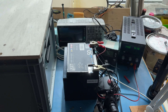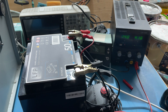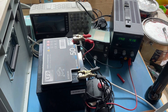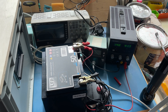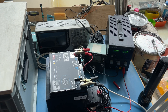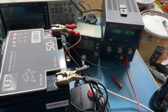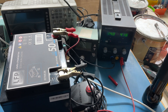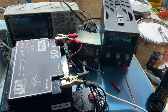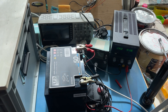Quick update: charging is still in progress. The voltage is going up and the amperage is dropping, simply because the laboratory power supply here is not constrained by a set amperage or voltage — it's effectively limited by wattage, maxing out at roughly 70 to 75 watts. As the voltage rises naturally, the amperage drops and the power supply stays more or less constant in wattage.